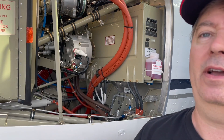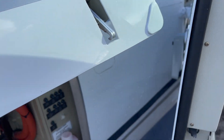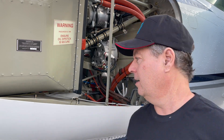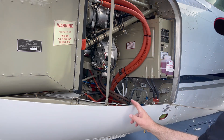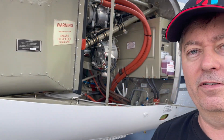When you open up the cowling you have three latches on the outside, one of which can lock. You have a couple of different ways to prop up the cowling. If you're going to keep the door open, they give you this handy little stick here because the chain that you use to lock the door interferes with the overall operation. You can prop open the cowling with this stick right here. The very first thing that you see, which is noticeable, is the inertial separator.